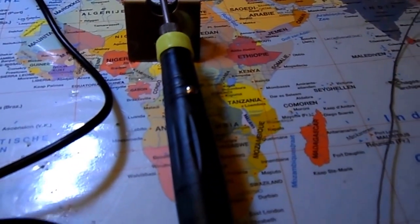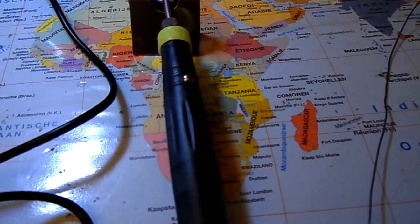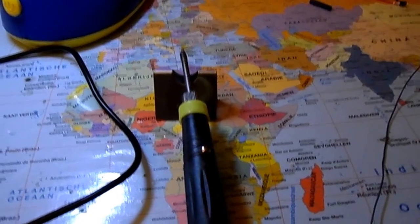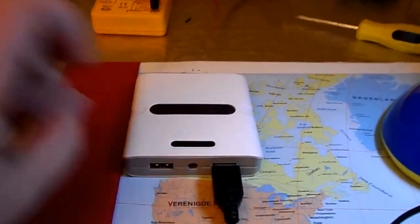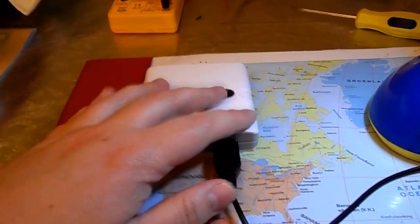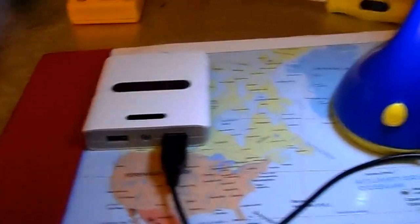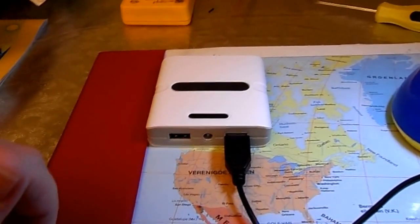Between the contacts of that, I made a soldering connection. So now every time the soldering iron gets power, it activates and stays activated. But I hated having to remove the plug every time because with a USB plug you have to observe the polarity — the way you turn it around and put it in — it's annoying. So what I did was cut the wire and insert a switch. Now it's easier to operate.